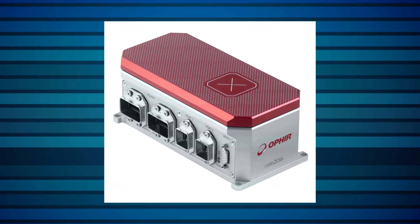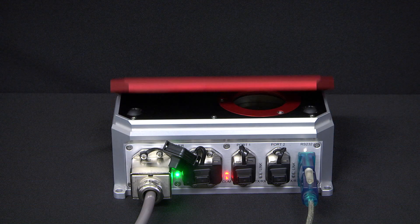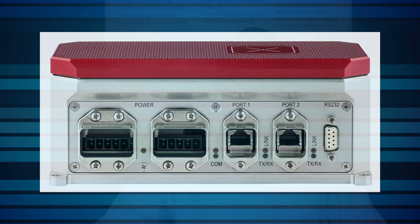The Helios is tailor-made for the production environment, with a robust body, motorized protective cover, and industrial interfaces — PROFINET and RS-232. It measures industrial laser powers up to 12 kilowatts. All it needs is a short pulse exposure from as short as 100 milliseconds, depending on the power. There's no need for water cooling. The footprint is therefore small and the process can be kept running with minimal interruption.